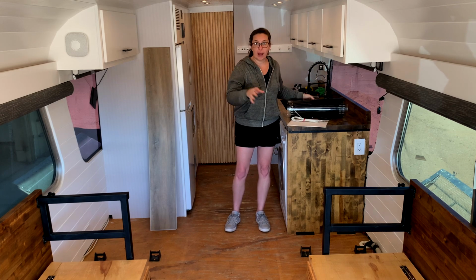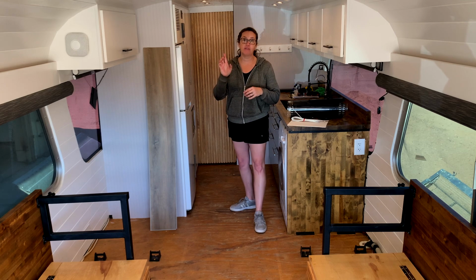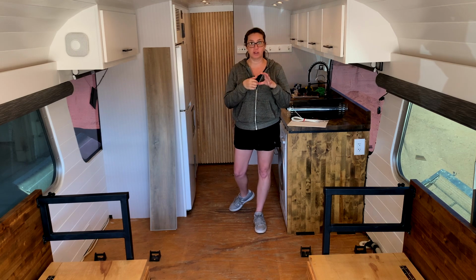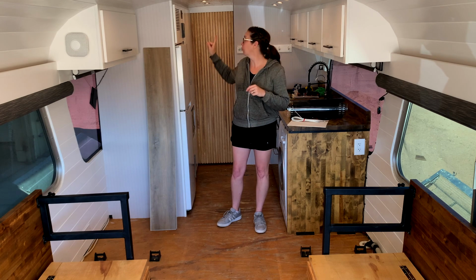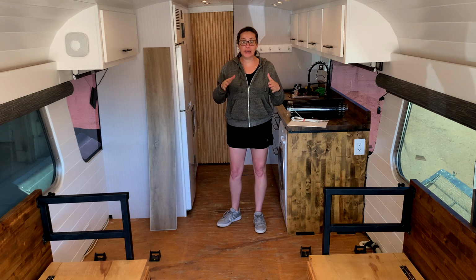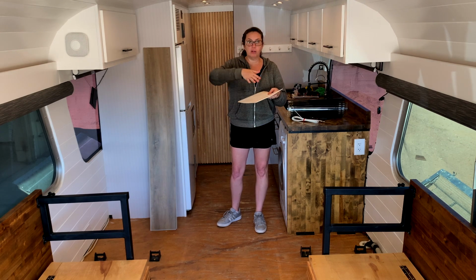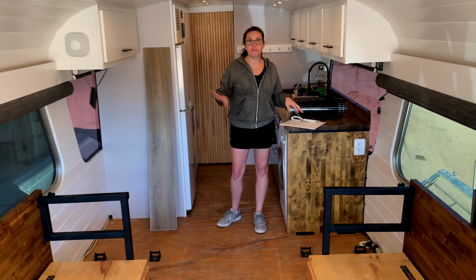All of our wires are gonna come and go to a central point, and then we have a wireless thermostat with a temperature sensor that we're gonna be mounting. Everything's gonna run into our broom closet. So we needed something with just a little bit of depth to channel out and allow us to run those wires without affecting our flooring.